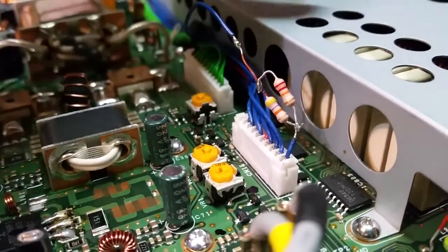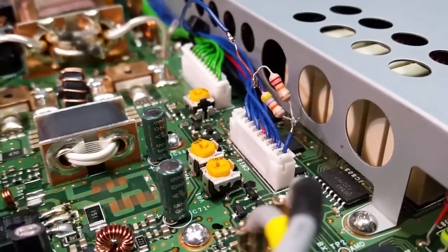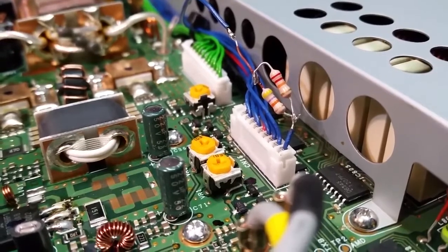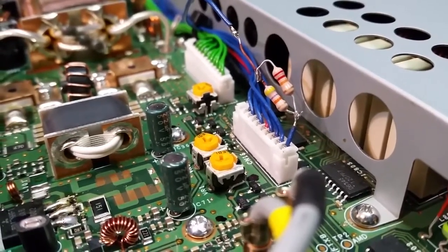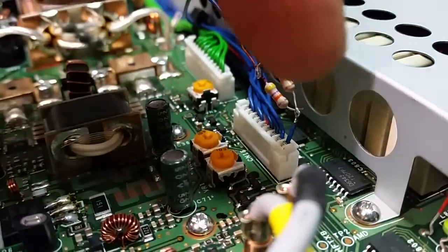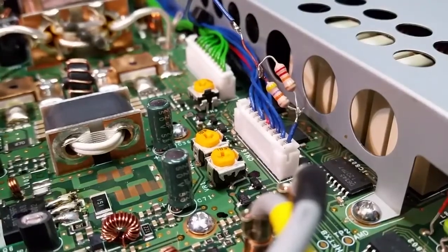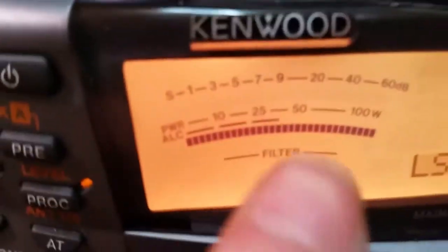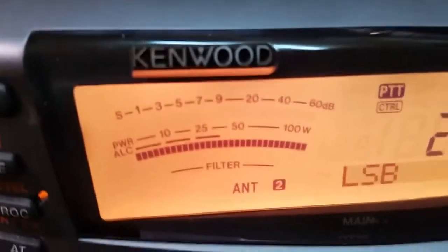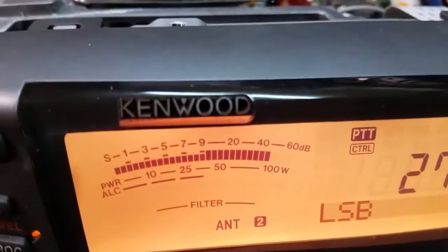This is not the way it's going to stay — I'm just temporarily set up like that doing my testing. But anybody else out there in the groups that wants to improve on this, please do so. Give me the exact values of resistors you come up with. What you want to find on this meter is you'd like it to swing to a full hundred — see how it's just shy of a hundred?